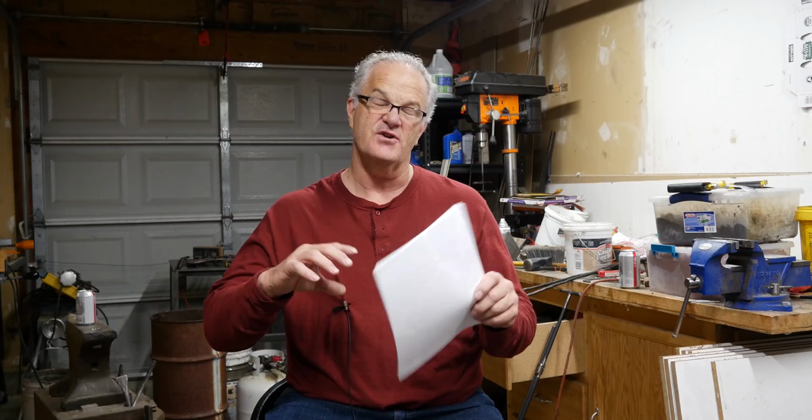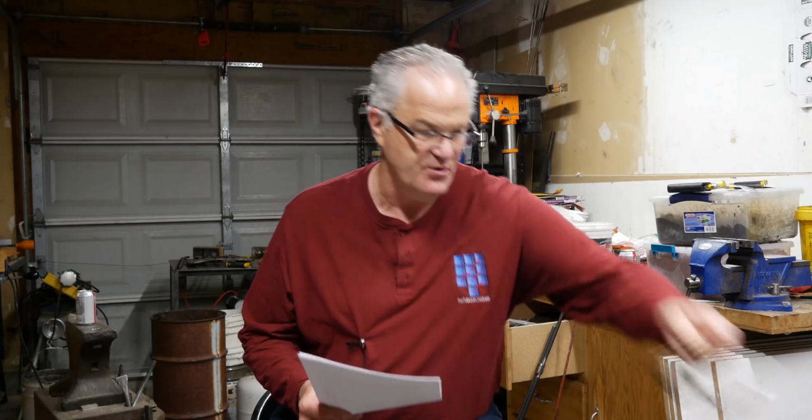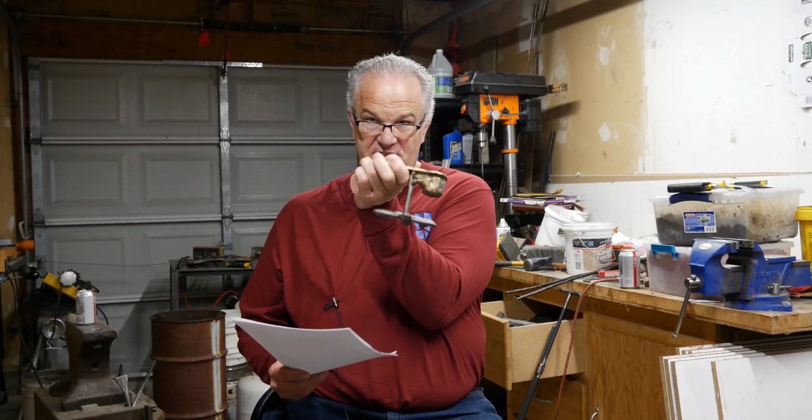All right, rule number 4: avoid bubble entrainment. All right, so entrainment, I didn't mention it. Entrainment means to incorporate. If you don't know, I had to look it up. That's what I'm telling you. No bubbles of air entrained by the filling system should pass through the liquid metal in the mold cavity. This may be achieved by properly designed offset step pouring basin. I think that's what I'm doing, is a offset step pouring basin.